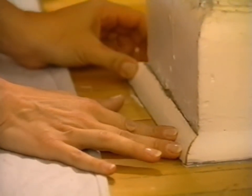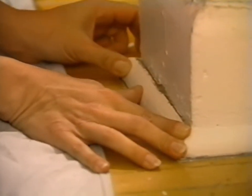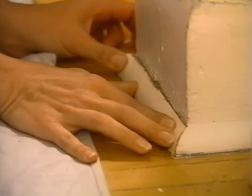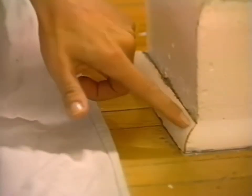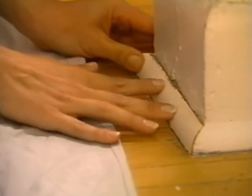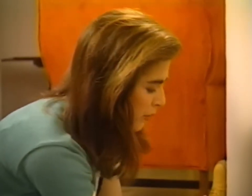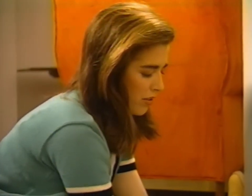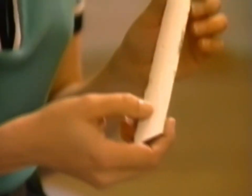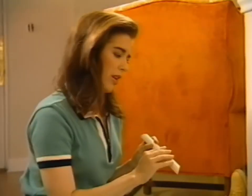I'm going to try — unbelievably, it fits perfectly. It's still a bit long, actually, but I'm going to call it fair. I'll be caulking around here so it's okay that we have a little bit of a gap. So the next thing I want to do is drill through this little piece of baseboard. This is a really, really short board, and I'm afraid that I'll split it if I just go ahead and nail into it, which is why I'm going to pre-drill. I'll do it in place.